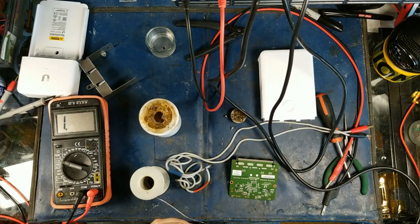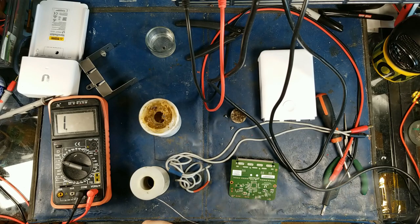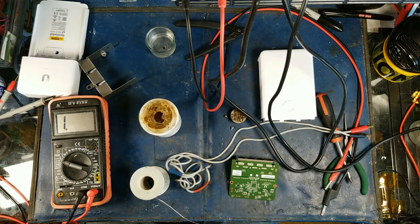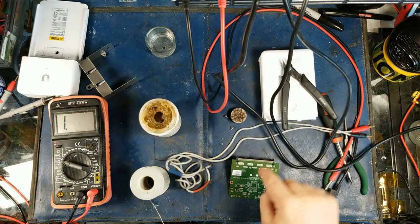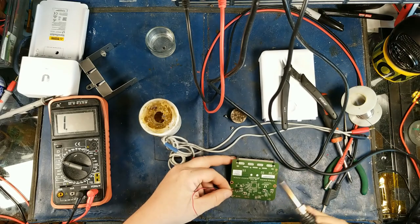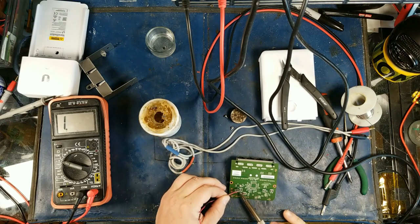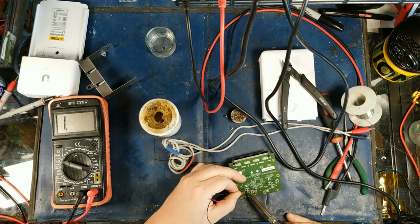Let's cut this in here. Since we only need tiny little bits of this wire — I really hope this works because if it does it's going to be amazing. I want to have the barrel connector on here, put it on the DIN rail in my truck, and then when I need to use my Ubiquiti radios or any other 24-volt radios I can simply plug in and run it off the bus in my truck.